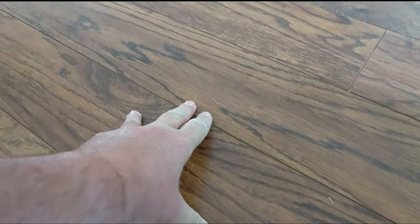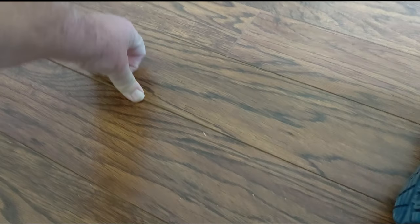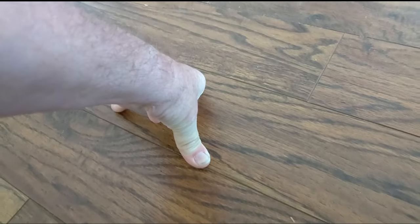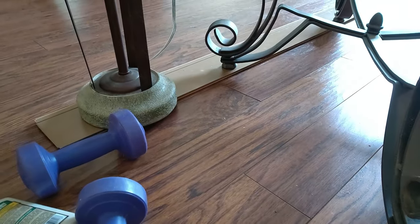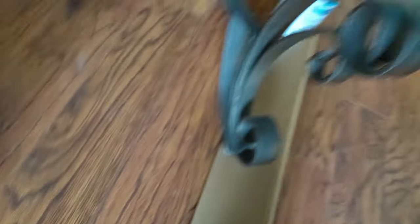The last board we glued to the board next to it on one side, so we have to leave weight on this for a week. We put a board of laminate down to distribute the weight a little bit. You can actually feel it — as long as it feels flush, then we know it's setting properly. And we're done! The real trick there was I didn't use my hands at all — that was my son Tristan doing all the work. I taught him everything he knows.